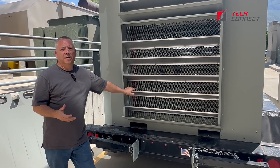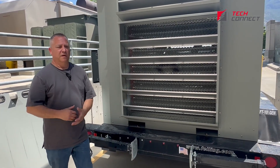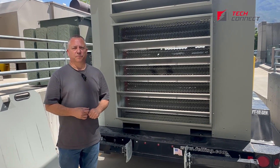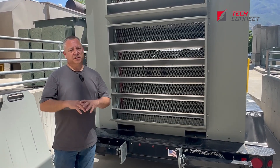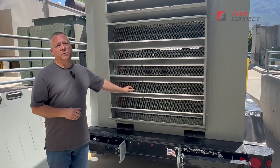Like the system we're testing today — it's been installed but hasn't been tested since installation. So you have input breakers that need to be tested, output distribution transformers, bypass panels, the battery systems that are tied into the UPS. We test the whole UPS system, and this load bank is one of the big tools that we use to do it.